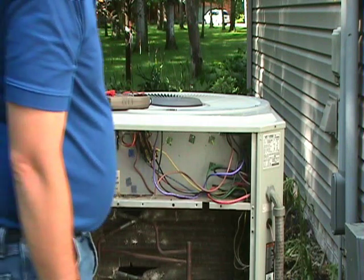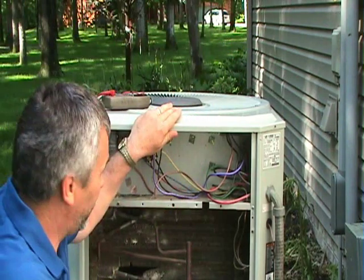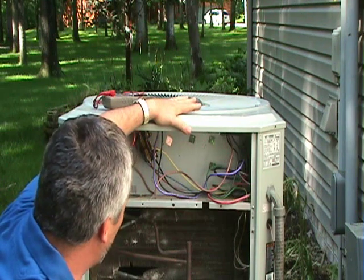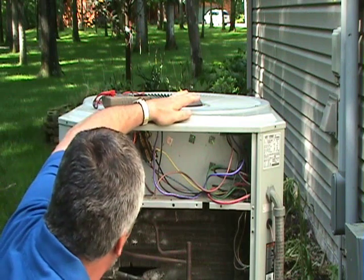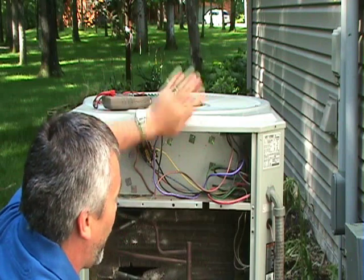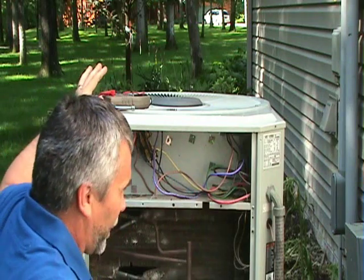The compressor is located inside the actual condensing unit. Usually the way to gain access to it is to take the top off of the air conditioner. On some models it's not necessary, but in this case it is. To do that, you start by disconnecting the wires for the condenser fan motor so that you can pull the top off and get it out of the way.